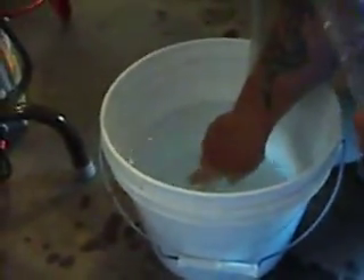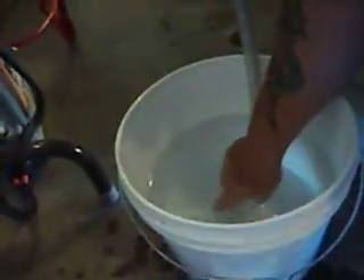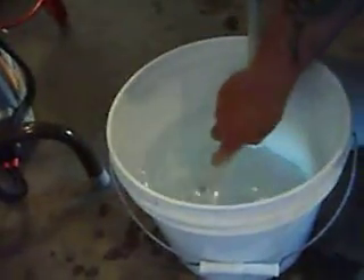This is a half liter bottle while we're checking the output of my new HHO generator. The time is only at 30 seconds. We just hit 40 seconds. And time — 48 seconds. So roughly 50 seconds. Even if it was doing 60 seconds for a half liter, that would be a liter every two minutes. That gives us approximately 30 liters an hour production out of this unit right now.